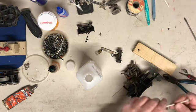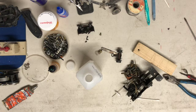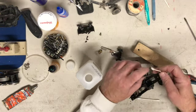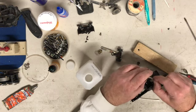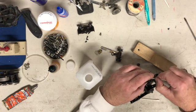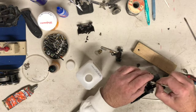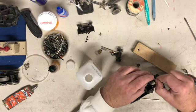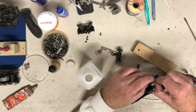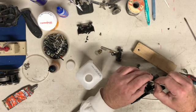I'm going to get the other end here ready to go. I'm going to pull a little fuzz off. I'm going to use a little bit of my degreaser. The degreaser is probably going to do a little bit better than the alcohol. You don't want to snag the little fingers and bend them or move them around. You just want to spin this slightly, get the copper band facing you, get that Q-tip on the copper, and try to clean it up the best you can.